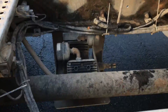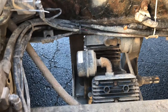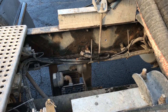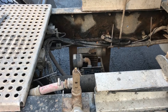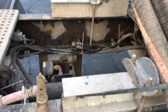One thing I do keep — there are two air filters, one here and one there. I check those air filters about once a month. I go to a lot of dusty farm operations, so those tend to get dirty fairly quickly. This compressor's a year old and I've only had to change the air filters once, and they're still pretty clean because I haven't done many farm deliveries lately.